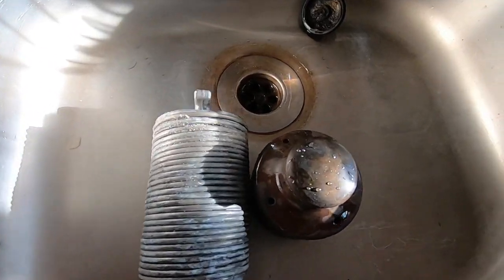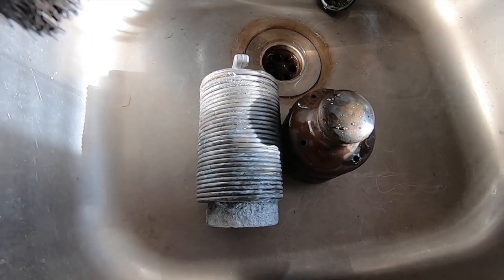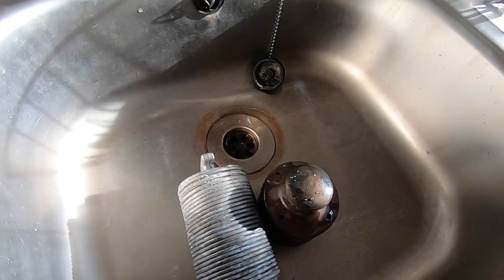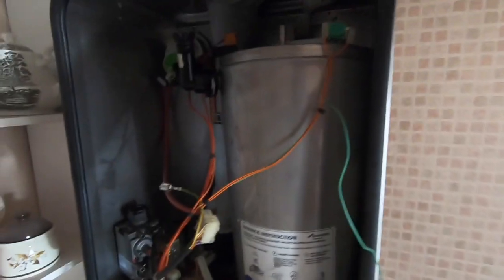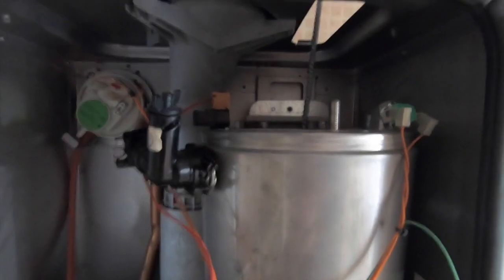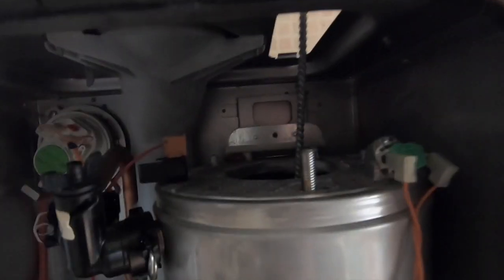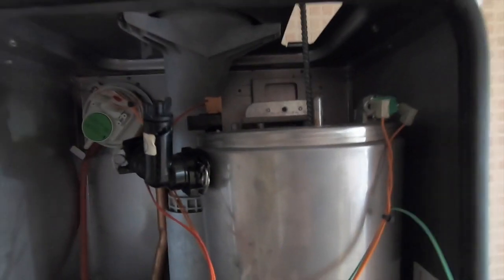Just soak the baffles in hot water with a stiff brush, get them cleaned out. Then we'll go back to the exchanger, clean that through, put them back together, new seal, and we'll be good to go. Another tool from Worcester — the little brush and big brush. Get that into the top of the exchanger, nice and deep, good scrub up and down, twist it. Then flush through with a load of water, send it into a trap. That should be it — put it together.